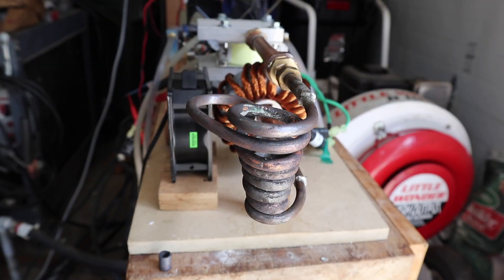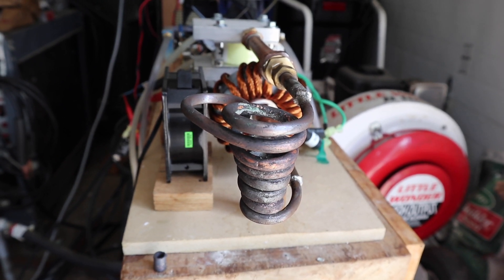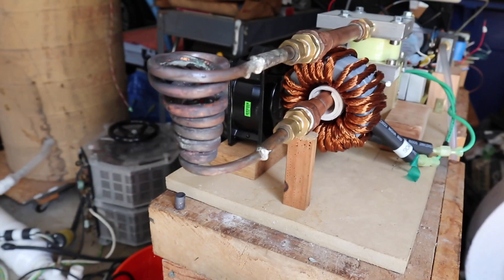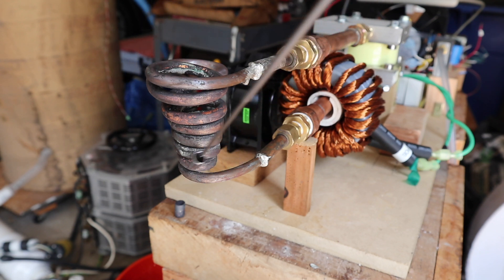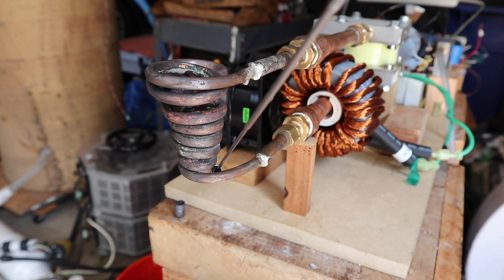Looking dead on here is the coil that I'm going to use for levitating metal. I've built this design so that I can easily swap out different coils just by unclamping and putting a different coil in. This one is designed with multiple turns going out in a cone, with the uppermost turn in the opposite direction to contain the floating up.